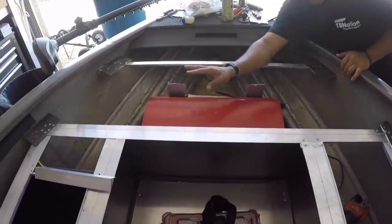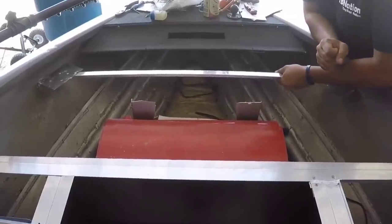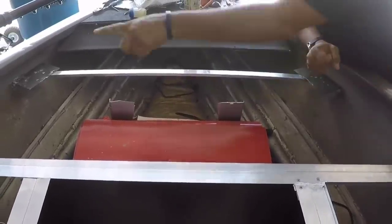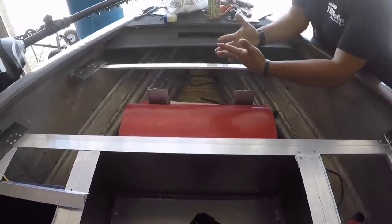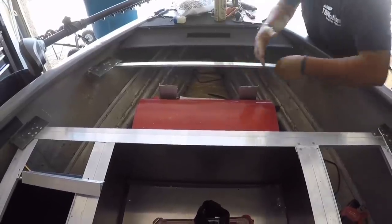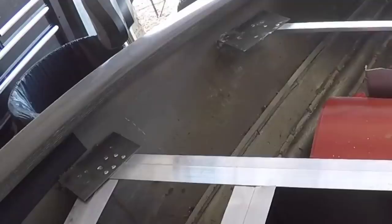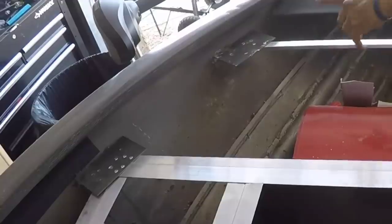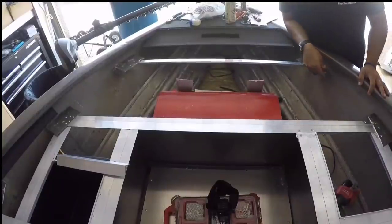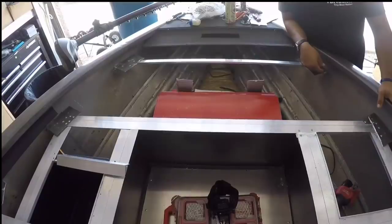This beam is really important. Making sure you have beams to all these major brackets — these are all brackets and major sections that help the boat from flexing in and pulling in when it hits waves. You definitely don't want your hull to start flexing and bending and folding. They had a pretty robust frame in here, but it was only tack welded into four sections, so we put joints in all the major sections and now have full-on rivets attaching all the sections to the inner core of the frame.